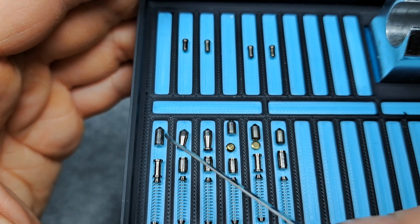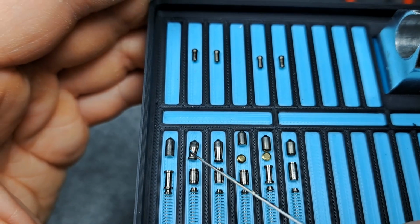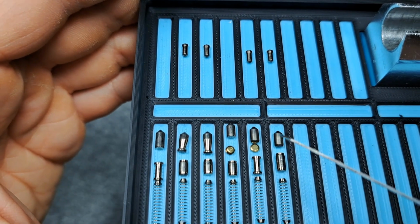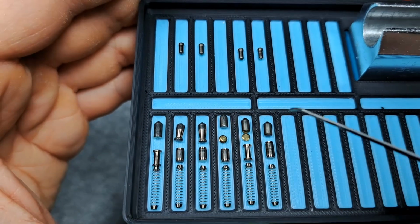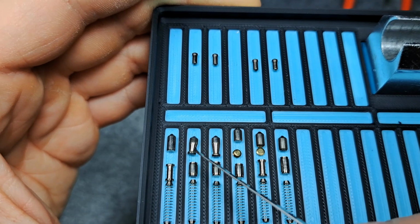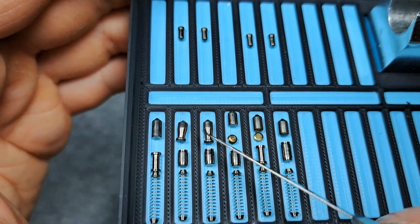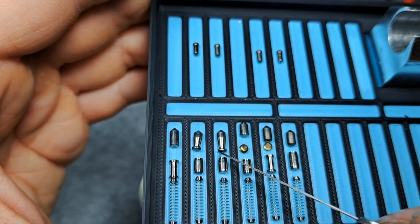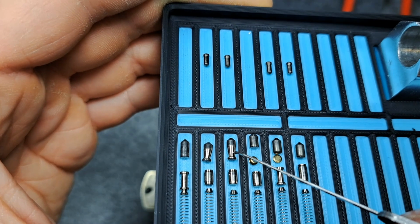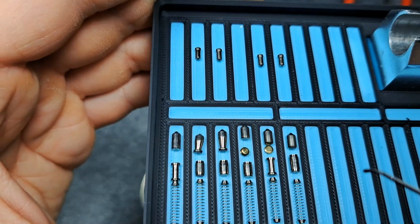And for the key pins, we have all steel pins for anti-drill, I think. Also the drivers are steel, so it's nice. They are really hard. You cannot easily drill through them. Of course you can at some point, but it will give you a good resistance. Then we have torpedo pins in chambers 2 and 3. Nice overset traps, especially here for these long key pins. You can easily end up here in this area on the shear line, and then you cannot easily reset those.